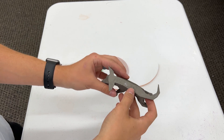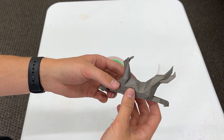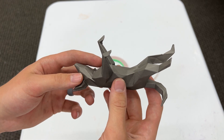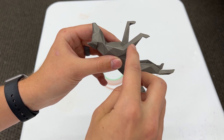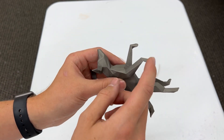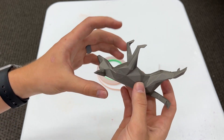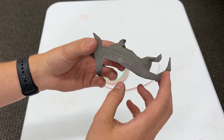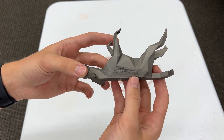It's been three days of painting this thing in our conductive paint. Now we need to make it a lot more conductive, because this paint is conductive but if we were to plate it as-is, where we clip it would only spread conductivity along that part. It would build up more as it went down the piece, plating this area more heavily than the rest of the body. What we want is an even plating area — conductive throughout evenly.